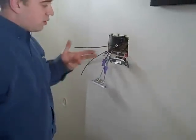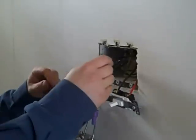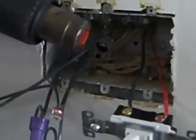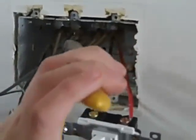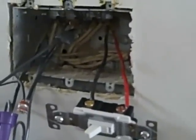With these connectors, because they are made of metal, once the power is turned back on these connectors are live. So we have to place an insulating wrap around each one before we can finish the box. This is the wrap — just stick it right on there. We use our heat gun, heat it up, it shrinks around the connector and it's perfectly safe. And one final touch because the end is open — give it a pinch, wait just a couple of seconds and let go. Completely sealed and safe.